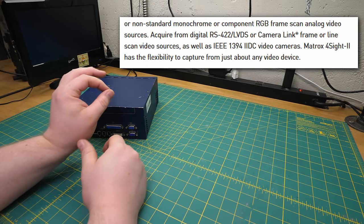As typical for little guys, they couldn't just use a normal power plug. We've got one of these godforsaken four-pin not-DIN things. The machine takes 12 volts; the supply outputs 12 volts. Unfortunately, there are many different ways to configure these four pins to deliver just one voltage and nobody ever agrees. When I got this power supply, the 12 volts was on the top with ground on the bottom — and here, the 12 volts was also on the top and ground on the bottom, except the connector is rotated 90 degrees, so if I'd hooked it up like that it would have shorted out the power supply. So I had to chop it up and play around with the wires, just stuck it back together with a WAGO connector. It works. Wow, that is a really loud fan. Now I have to talk over it the whole time.